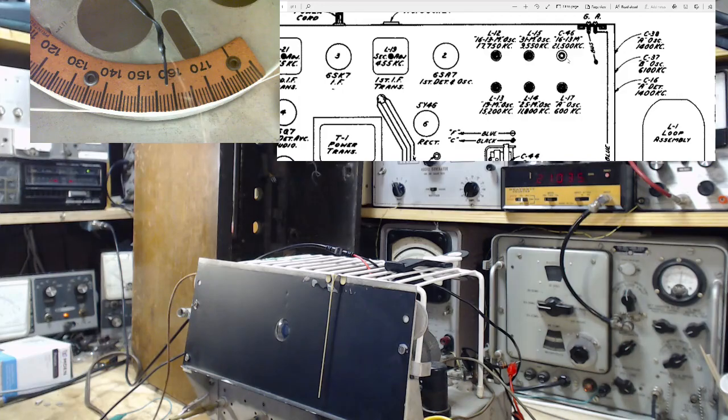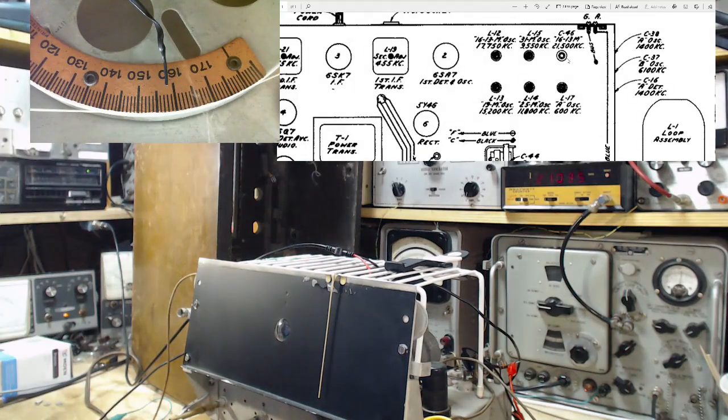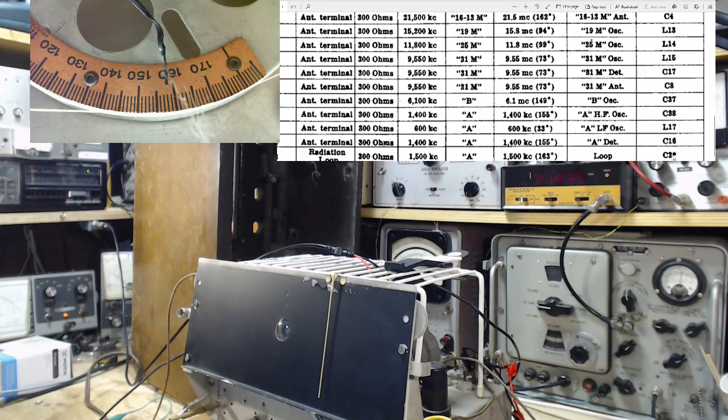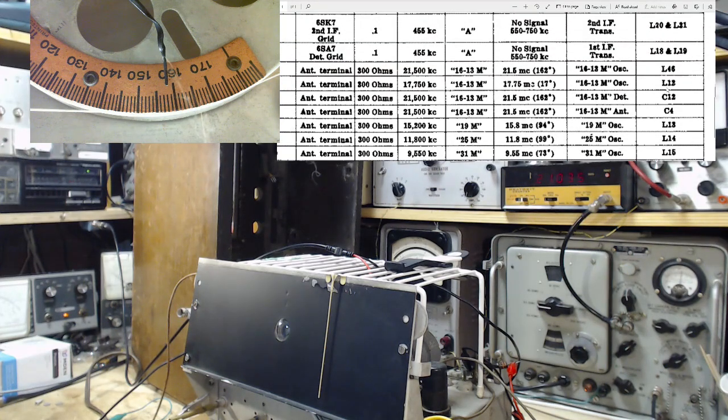I'm looking at it. So in the back of the radio, a little hard to see in the camera, the adjustment here is a capacitor. So this really is C46. So then what the mistake is here. Does C46 show up anywhere else? No. So that's supposed to be C46. Gotta be. And that makes sense too, because you're up at the high end of the band and you're doing a C. C46, good. I didn't do anything to that last time. Goodness knows what I did the other day. I was thinking too much about sunshine and plants.